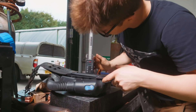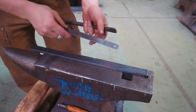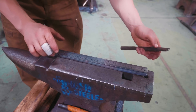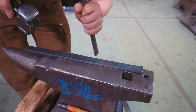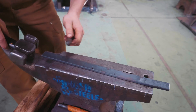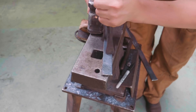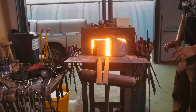Let's go to the fire — first, a little rasping. Let us determine the exact height we need: 91 millimeters. Now, on yesterday's episode you saw me use the anvil to lay out where we're going to do the bends. Another way of doing this is taking a fuller and doing the same thing at a lower temperature. So we'll mark it out. This is a fuller line — that's a bend there. Another fuller line for another bend. Here's a center punch mark for a hole, center punch mark for another hole. I'll use the center punch mark just on the side of the material for our chisel, and transfer those marks on over. So this is the bracket for the electric fan unit housing thing.